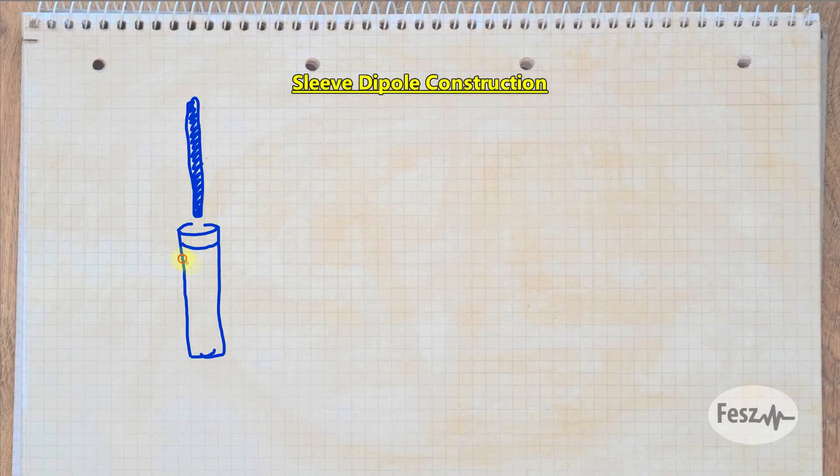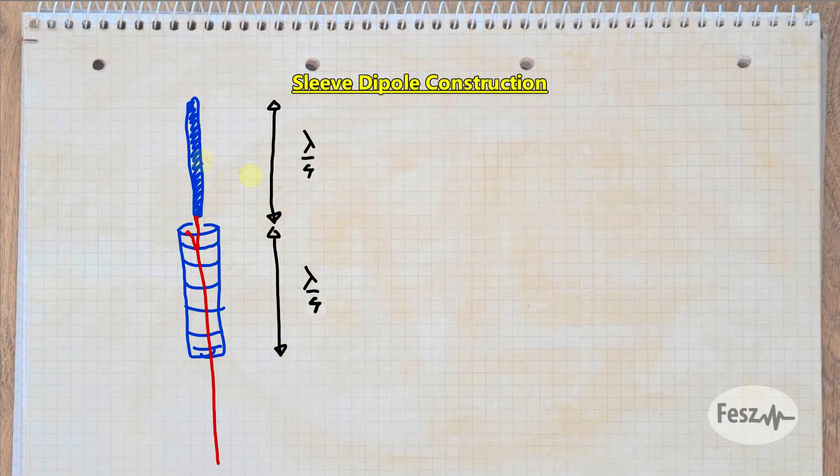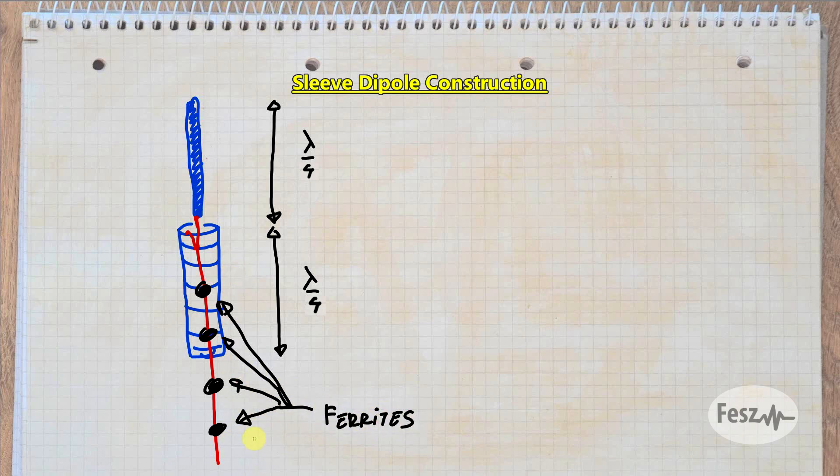That is the basic idea behind the sleeve dipole — one of the antenna elements goes over the feed line like a sleeve. Before going any further, let's discuss how such an antenna should be designed. Most explanations start by saying that the two arms need to be of equal length, equal to a quarter wavelength at the target frequency, so at the end of the day, this thing is still a dipole. Usually there is a mention of a set of ferrites on the feed line, either inside of the sleeve or extending out onto the feed line. The idea is to prevent the field lines from the top radiator closing onto the feed line, but also to decouple the support structure from the antenna. One further advantage of this technique is that it makes the dipole unbalanced, so you no longer need a dedicated balun when feeding it.